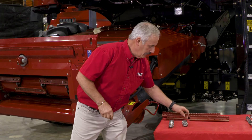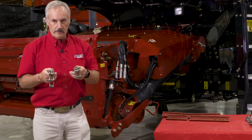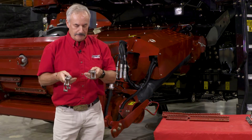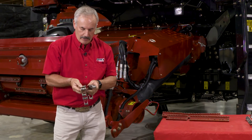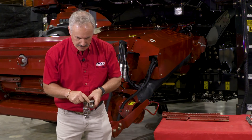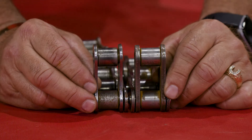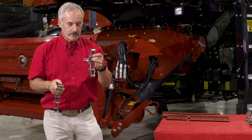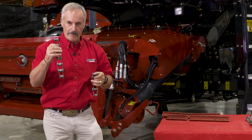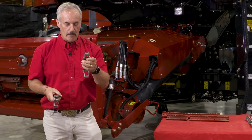On the chain itself, we went to a heavier chain on the 250 series — you heard Victor talking about it. The main difference is if you look at the inner link here versus this one, you'll see this one is quite a bit thicker and the pins are also a bigger pin. This is a much stronger chain than before. This would be your 960H chain; the CA557 chain is what we used in the past. The 960H is what we use on all 250 series combines.